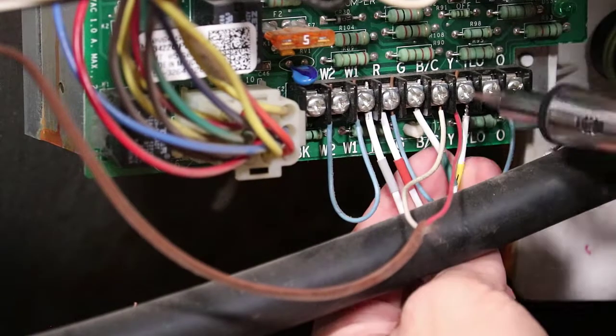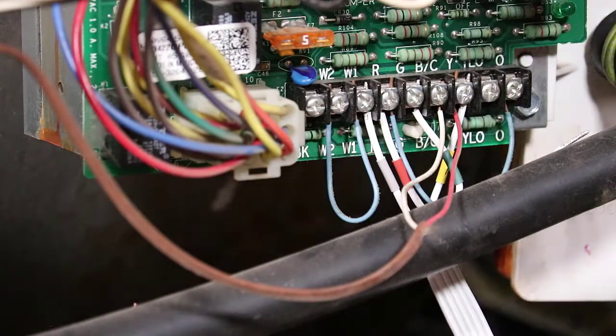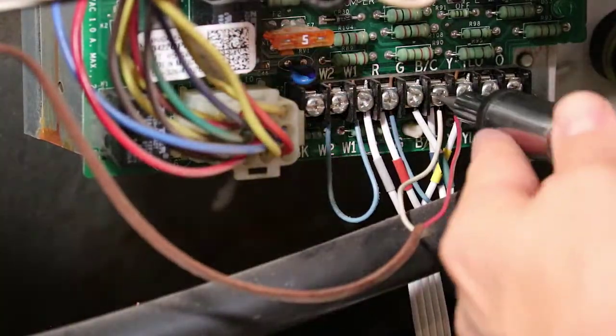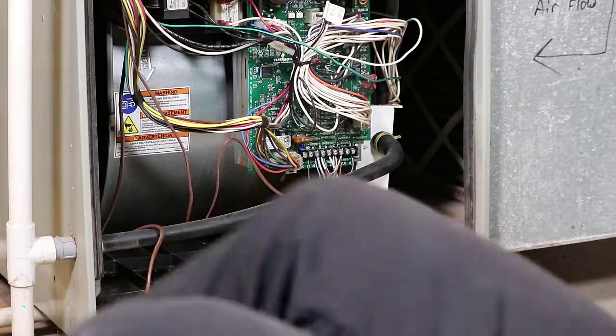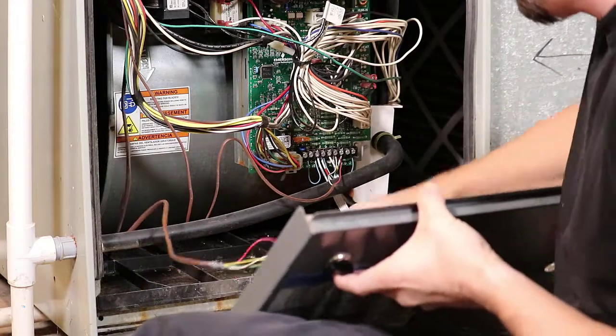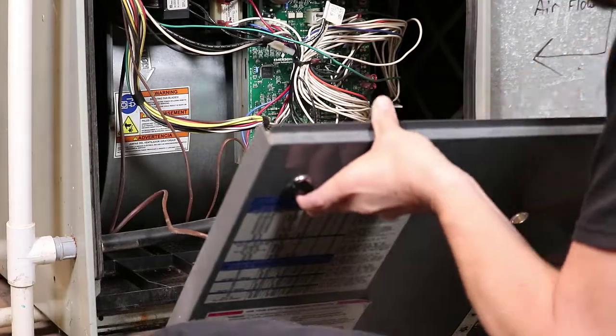The reason we are doing this is to complete an independent circuit to power the thermostat directly, because smart thermostats pull significantly more power than the older thermostat that was replaced. The only thing we have left to do is mount the PEK inside the furnace controller bay and button the furnace back up. The PEK device has a magnet on the back to stick it to any metal surface inside the bay, so it is fairly easy to mount in there.